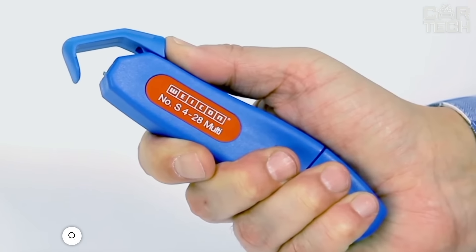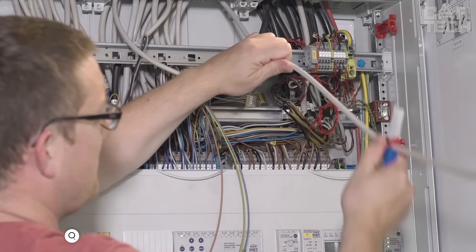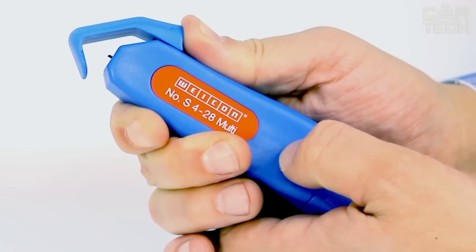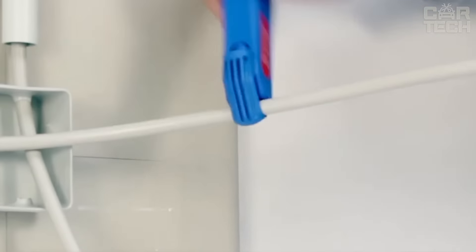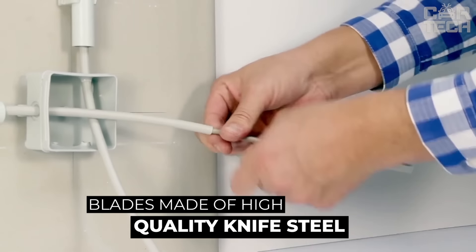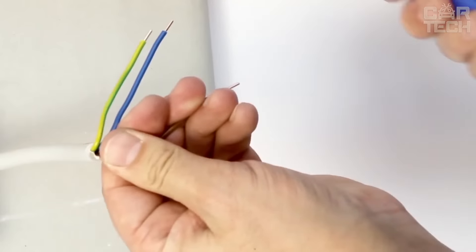Precise, fast and safe stripping is all about the Wicon cable knife. It is perfect for working with round cables from 0.16 inches to 1.1 inches in diameter. The adjustment screw on the body provides smooth depth of cut adjustment to prevent damage to internal conductors. The built-in self-rotating cutting blade provides automatic switching from circular to slitting. There's also a wire and strand stripping feature built into the body. The tool is made of durable fiberglass-reinforced polyamide and its blades are made of high-quality knife steel. It has an ergonomically shaped handle and is fully insulated for safety.